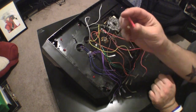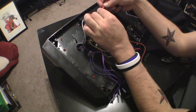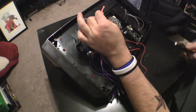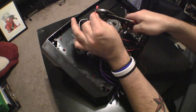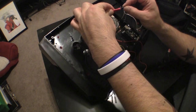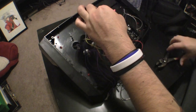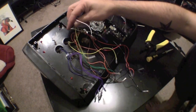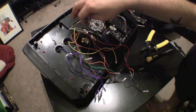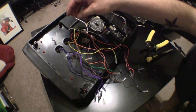You're going to need what's called a butt connector to extend the start and select buttons. You insert the wire into the butt connector and then you grab a pair of pliers and apply a lot of pressure to make sure the wire stays in there nice and tight. Then you grab your extra piece of wire, insert it into the other end of the butt connector, and repeat with the pliers. Another quick tip, for the start and select button ground wires, you're going to want to take off the sleeves and then combine the wires together, so then you have one ground wire instead of having two.